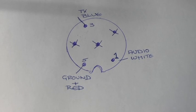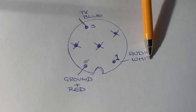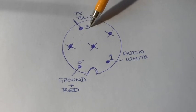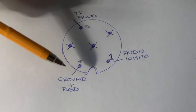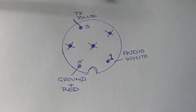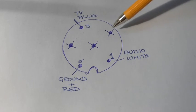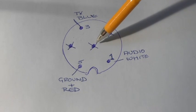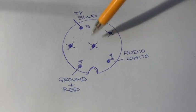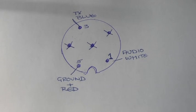To finish up — here's your reference. Not the most technical diagram in the world, but we're interested in the connections. Pin 1 is your audio pin — from the Expander 500 that's the white wire. Pin 3 is TX switch — from the Expander 500 that's the blue cable. Pin 5 is the ground — from the Expander 500 you connect the screen wire plus the red together. The ones we don't use: we've pushed out pins 2, 4, and 6. Very important — the live pin 6 carries 13.8 volts; if it gets connected with any of these, you are in dead trouble. Pin 6 — the pin of death. See you next time.